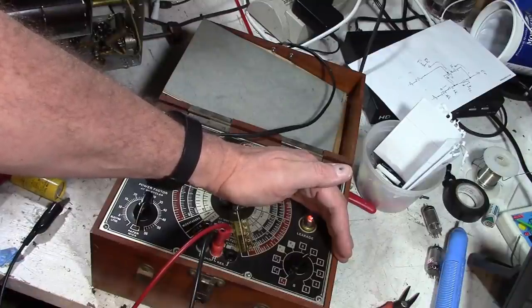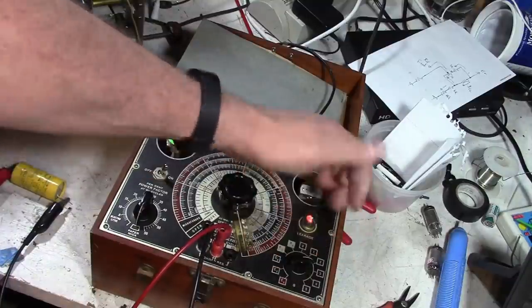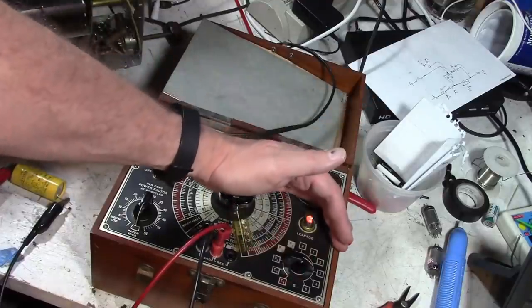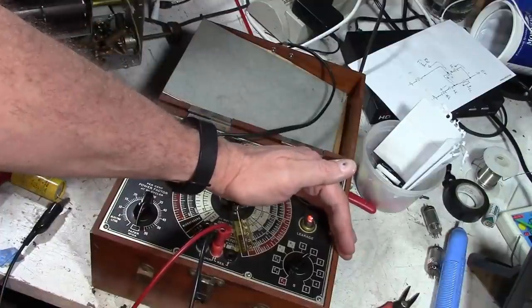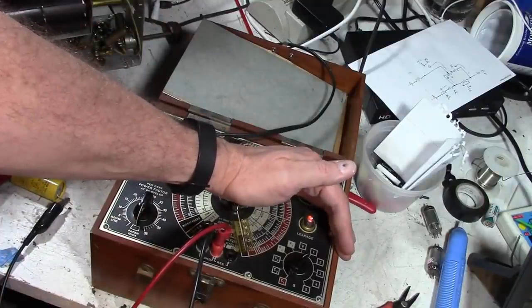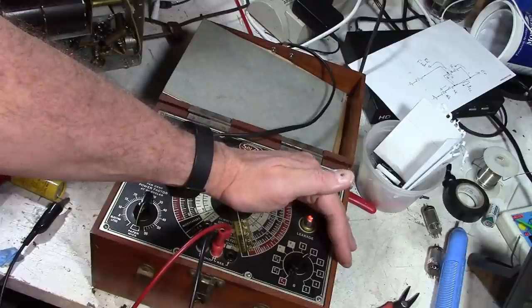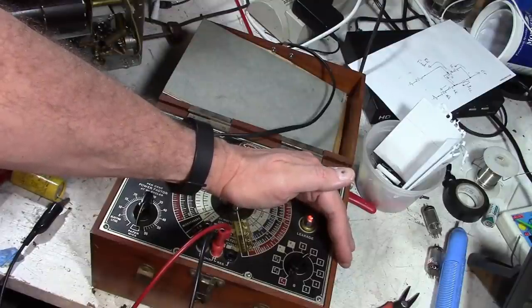And wait. Maybe after 10, 15 minutes, the light would go out. Then you go up to 200. And wait. And so on. Or we could put a new cap in. The fact that it's leaky at 100 and this much for this long, it's a pretty bad cap.